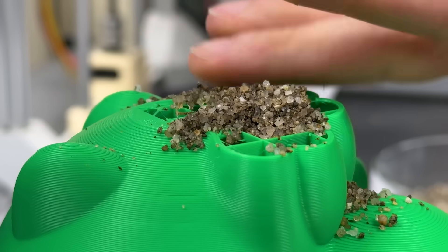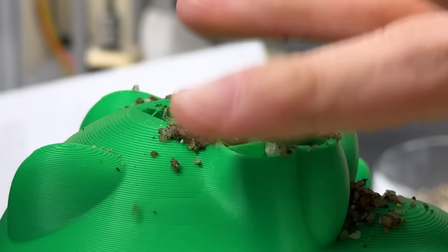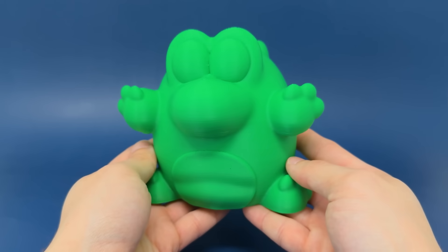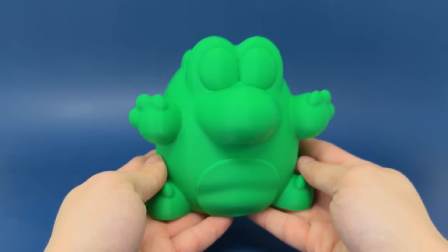You also risk contaminating your 3D printer if you're dumping sand into it. And if you use sand or lead shot, you can end up with a maraca effect — material shaking around on the inside, which does not feel solid and premium. This is a good way to make something really heavy using denser items than standard plastic, but you're still shipping something heavy, increasing costs and requiring a lot of extra effort.